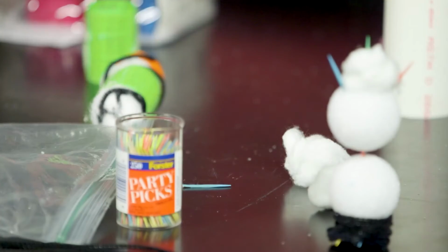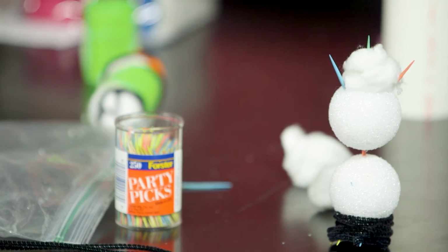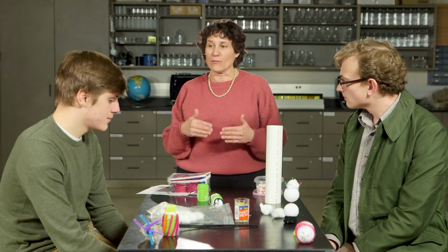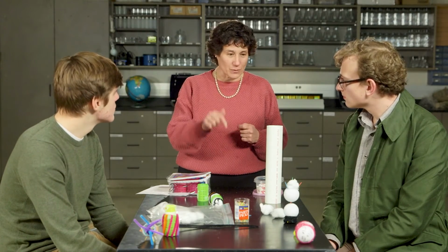Awesome. Real pigs are longer than 5 feet long. They may have cameras, and they call those smart pigs. They may have cleaning brushes or other attachments depending on their function. Many of them are self-propelled, so you don't have to push them or pull them. If they're not self-propelled, they're attached, and they're doing just small sections at a time. They're attached to either another runner or they're actually attached on a line, and they can pull them through one way and back the other.